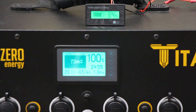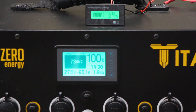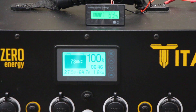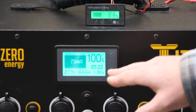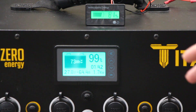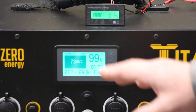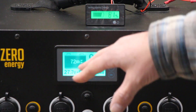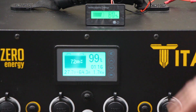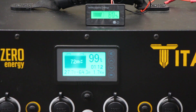If you have more than one battery and you want to balance them so you can stack them — you need to balance them before you stack one on top of the other — just go through that process for each battery. Charge it up until this calibrates to 100%. If you set it down to zero and wait until it jumps up, then you know it's done. Otherwise you can watch the voltage and make sure it goes up to 29, or watch the green light on the AC charger. Do the exact same process with both batteries, then stack them on top of each other and turn it on.